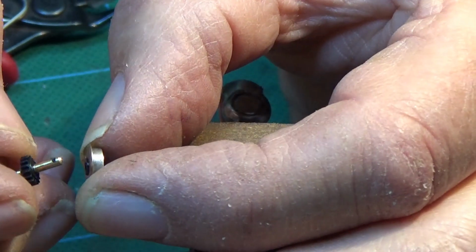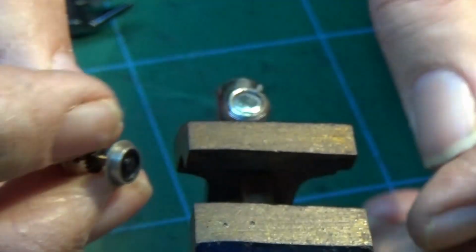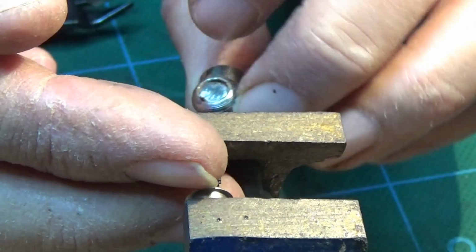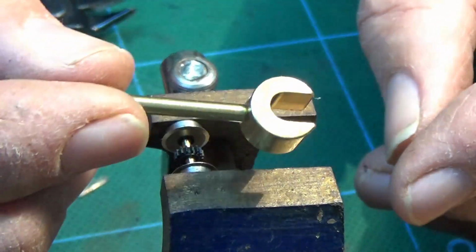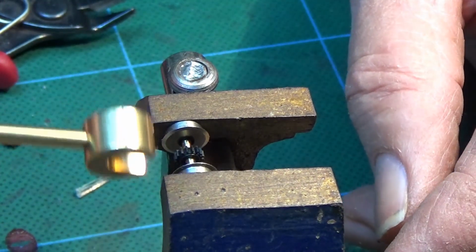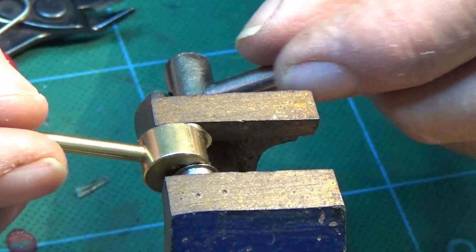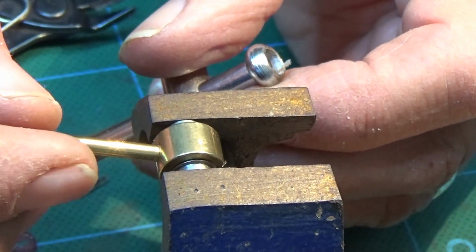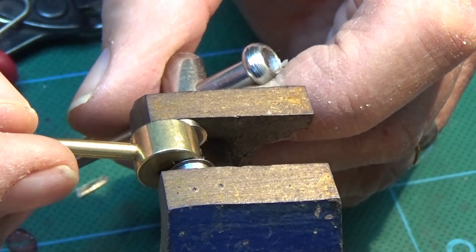Now I have to apply the old wheel. It goes onto the edge, and I just feed that into my vise till I get tension. Then using a 9mm end gauge, back to back, I just gently squeeze until the back to back just moves and no more. There.